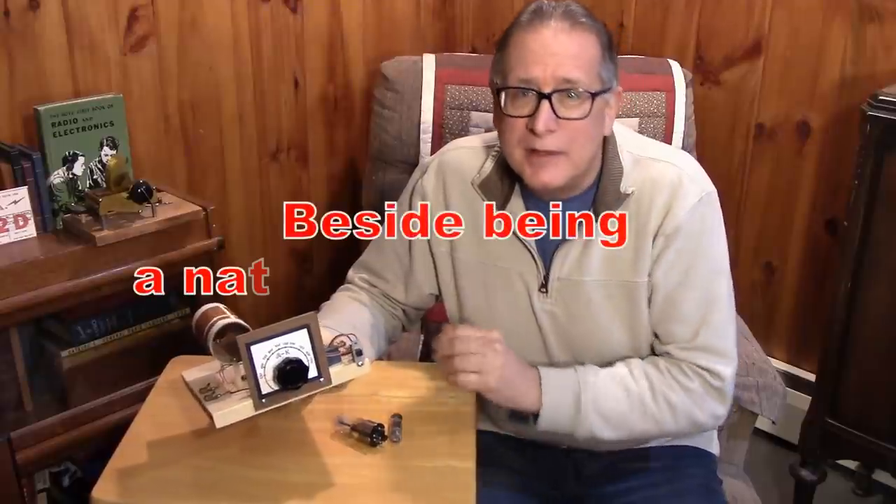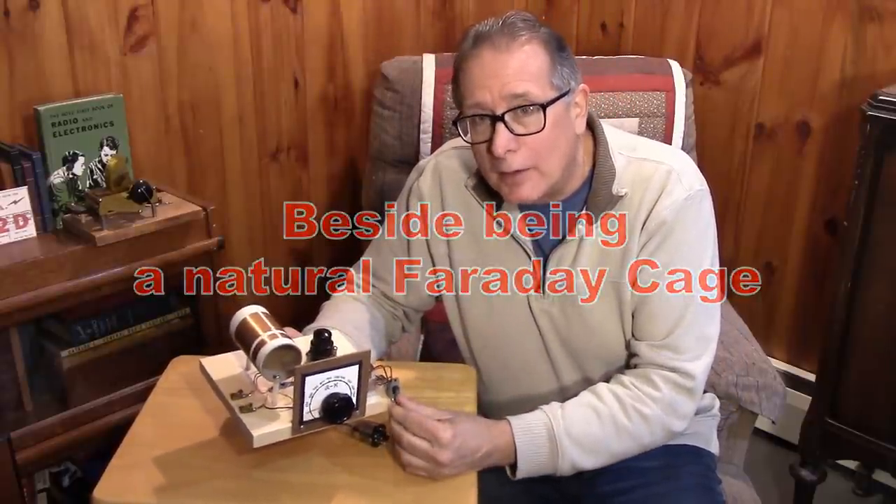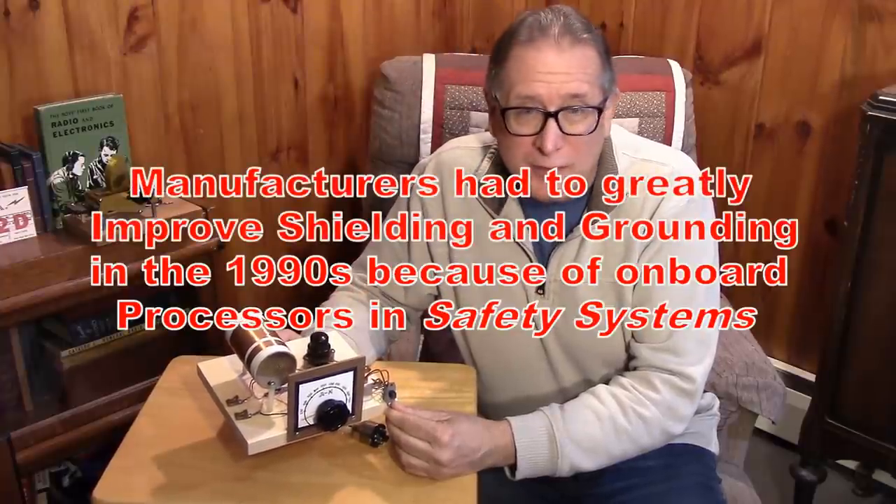When you bring up EMP, people get very nervous. They talk about your car suddenly not being able to work. I was doing some consulting back in the 90s and got to be out at the Chrysler Proving Grounds where we actually bombarded cars with high power levels at all frequencies. Basically, you've got a CB'er and a big truck next to you running a 5,000 watt linear. Have you seen your car go out of control? No, you haven't. Cars are one of the most EMP-proof devices there are because of the shielding and grounding required to make all those computers RF-proof.